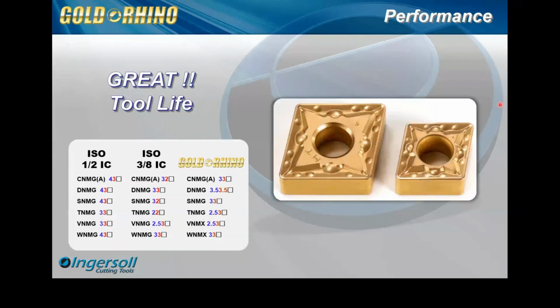Okay, I want to continue on a little bit. We know that it's a nice price savings, and we want to get to the performance a little bit here, and kind of why these sizes are performing. So I know some of you, including myself, have been around for 20, 30 years in the industry. The CNMG 332 size here is not brand new. It's newer in the last few years, but I believe Valenite was one of the companies that had this size as well. But their issue was the performance was not as good. The 332 in their size still could not get the same performance as the 432.